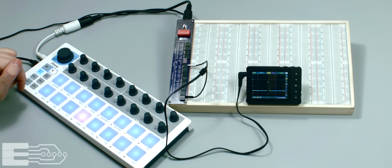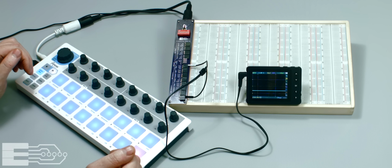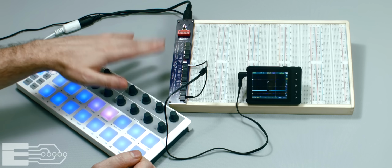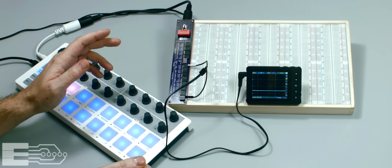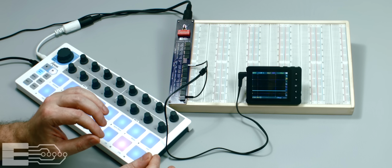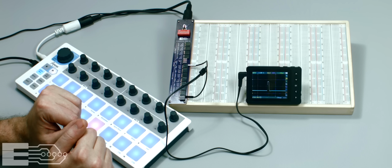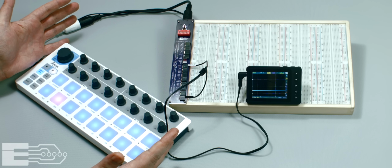So this allows you to sync whatever circuit that you're putting on the breadboards up to whatever's coming down the MIDI pipeline. So you can turn on a light whenever the MIDI beat hits, or your clock circuit can keep track of where you're at in the song. Gotcha. So the latch pin comes up and drops when the song first starts, and for each MIDI tick, the clock goes up and down. So your circuit, say you're using logic gates and stuff like that, can actually keep track of where you are in the song. Like if you were going to be building a sequencer on your Protosynth Midi breadboards that you wanted to sync up with your digital audio workstation on your computer or your outboard, stuff like this.